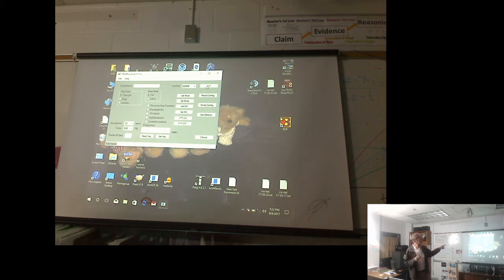And there's a little button on here that you can select either CW or CWR. If you hit the button and nothing changes, then you're right on frequency. But if you hit the button and all of a sudden the signal disappears, then you're not on frequency anymore, so you've got to kind of tune around to find it again. It's just an extra step you have to do with a very simple receiver. This receiver actually has no tuned circuits in it with the exception of an input filter. And it basically does the bandpass by the audio frequency that the audio amplifier is set up for.